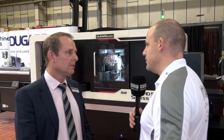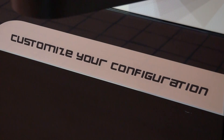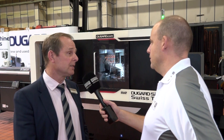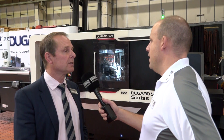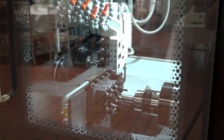It's got a lot of tools in there as well. We've got total flexibility — a lot of selection of tools and options for changing the tooling configuration, which gives you a lot of flexibility. The nice part is that it can be run as a guide bush machine, which gives you 42mm capacity as a sliding head. Or if you want to take the Swiss aspect out of it, you can remove the guide bush and get 51mm bar capacity. So I'm identifying this machine as a very good in-between machine.